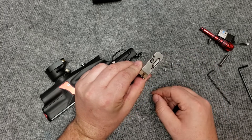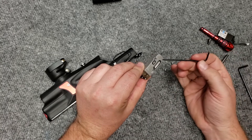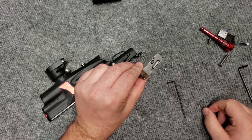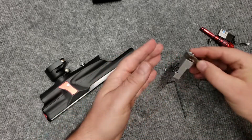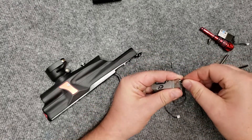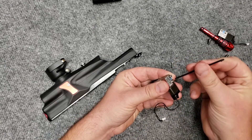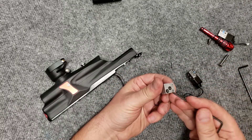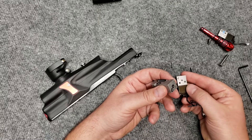We have two o-rings here, and this o-ring here has a little 1.2 to 1.5 millimeter space in there that'll help slow the air down — but we're not dealing with that today, we'll get into that more later. Be careful when you flip this over, as these components can pop out. Take your allen wrench and undo the solenoid. Down here you'll see the two three-millimeter o-rings — these are 3mm by 1. Make sure everything looks good down there and that you have good surfacing.